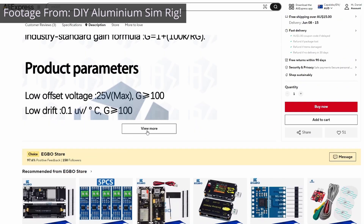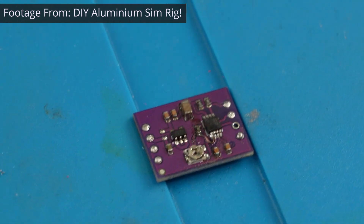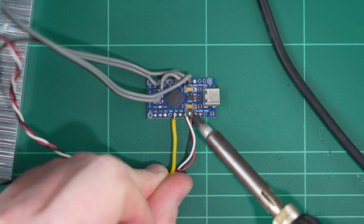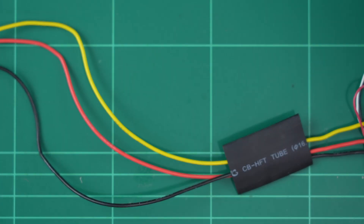We still need to tackle the electronics, so let's do that now. I'm going to use the same INA-333 board I used for the pedals — it's cheap and does a great job of amplifying the signal to a level that our Arduino can read. This board does require some basic modifications to function the way we want; I won't go into detail again, but there's a link in the video description to the other video. Since the shifter is right next to the handbrake and has plenty of spare I/O available on its Arduino, I'm just going to add the handbrake to that to save having too many USB devices connected. Vout goes to one of the unused analog inputs — in this case A1 — and ground connects back to a ground pin on the Arduino. Note: you also need to connect a VCC pin from the Arduino back to the VCC pin on the INA-333 board. I eventually plan to make a neat PCB for connecting all of this together, but this will do for now.